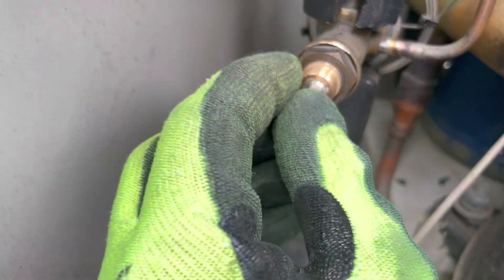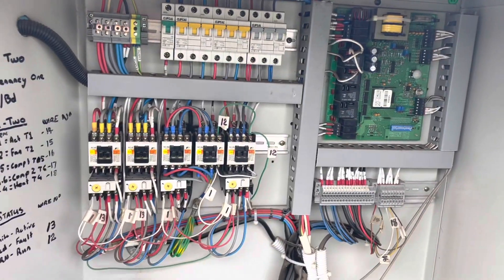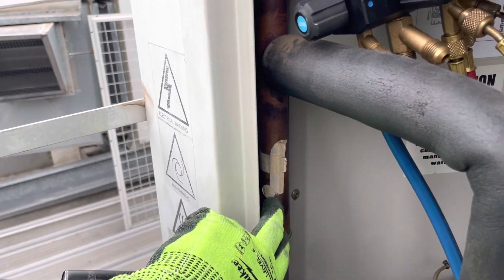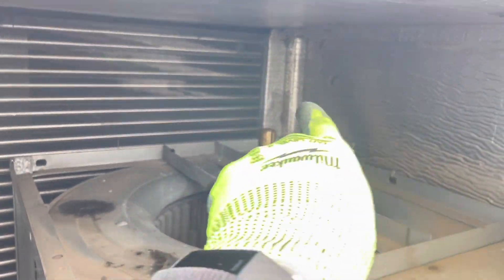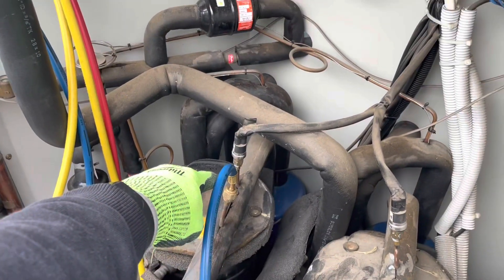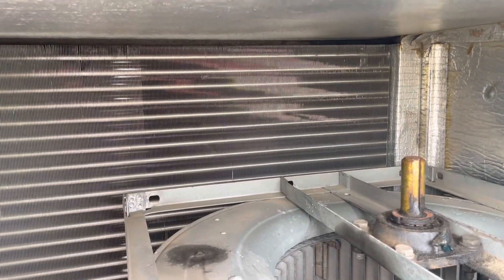I found it - there's a leak. You can hear that right at the stem there. I'm going to keep doing a visual, have a look down here and see if anything stands out. Having a look at the other side of that coil as well - I can't get access to that side there, so it is what it is. I'm fairly confident that that's our main issue. I'll probably replace the Schrader cores as well. We'll just do a visual to really confirm that we've found it.